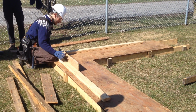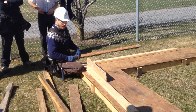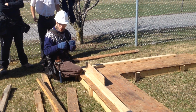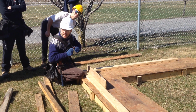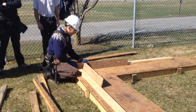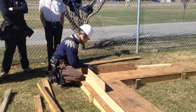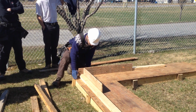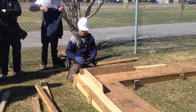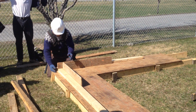So as I said before, oftentimes the way we think is that our shorter side over here would have the material passing through, because we don't want to cut material. We want the shorter lengths to extend. That's just a rule of thumb. So that's how I would probably have this shoe pass over here, like this, and like that. So at first, I just place it to help me figure it out. I have this one passing, I have this one butting, so I'm putting it on the line about like this.